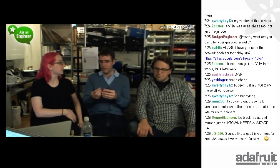That's why it's called a vector network analyzer, because you're actually analyzing a whole network of parts, including the parasitic capacitance on your little leads. You want to use tiny little parts to reduce the parasitics, but you use an instrument like this to measure that whole network of factors to determine the impedance, because it's your trace width.